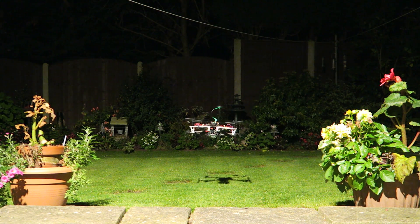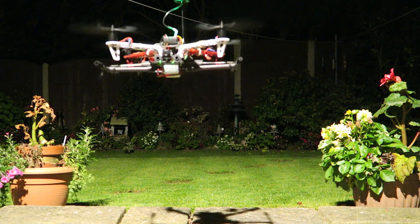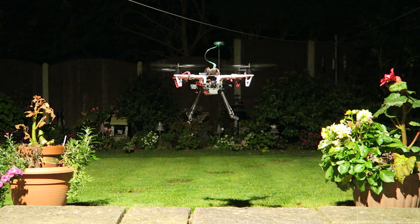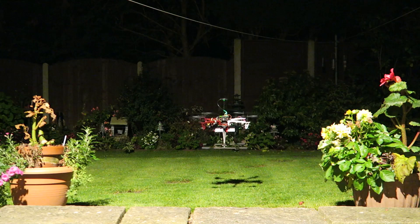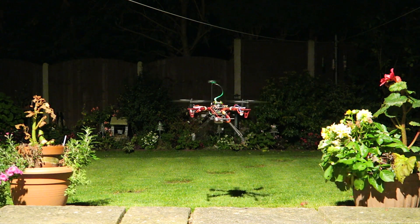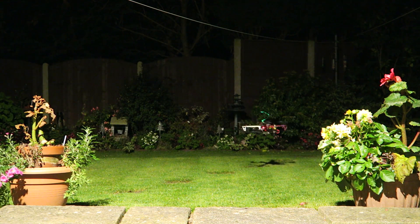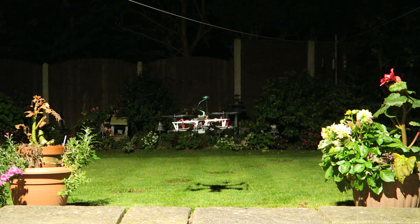The aircraft is lifting everything no problem, which I am pleased to see. So far the flight characteristics have not been affected either — I was worried I would have to change the PIDs or redo the auto tune, but that has not been the case. I have the battery situated in the middle of the aircraft for now for balance, however when I fit the gimbal it will sit at the back. The undercarriage retracts fairly slowly but I am happy with this — it sits at a nice height off the ground and is very steady. What I like about this hybrid build is that because it is designed for a slightly smaller aircraft, when the legs are in the up position they do not extend past the frame of the quadcopter, which means it looks neat and is really nice for storage as well.